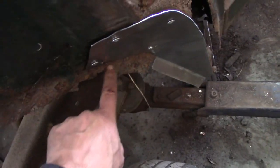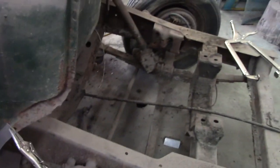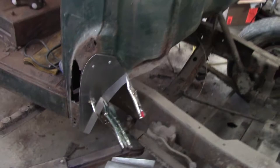I'm going to make a piece for here and bring it up around to get that profile. Most of this I'm just going to trim, wire wheel it and treat it — same thing on the other side. I don't think I need to replace all that. Once I get this all welded together I'll trace it, trim it out, cut it out, and weld the new pieces in. One thing you learn from doing this kind of stuff is patience — just about anybody could do it, it's just a matter of having the patience to learn it and keep going at it.